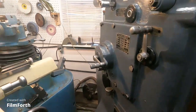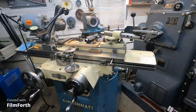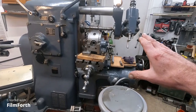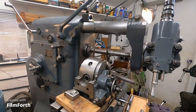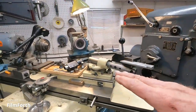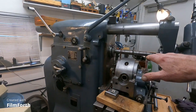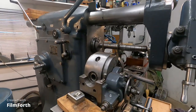I've been busy, busy, busy. I got all my grinding done — that's just great. And I got the cutter grinder all cleaned up. Isn't that nice? The neat thing about the cutter grinder and the horizontal milling machine — and some people might know — these things are sort of obsolete anymore. You can remove the arbor with the cutter on it, bring it over here and put it in the machine. I have a tail center and you can grind the cutter right on that arbor, then put it back in, and the cutter is perfectly true. That's kind of neat.